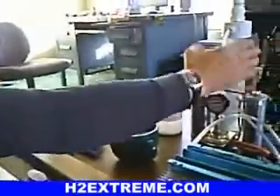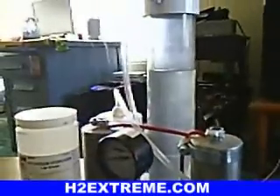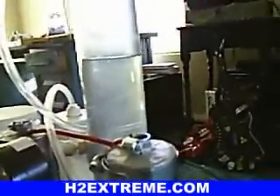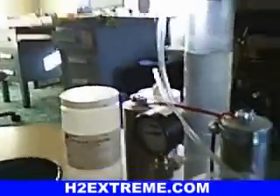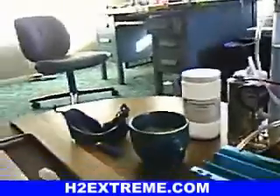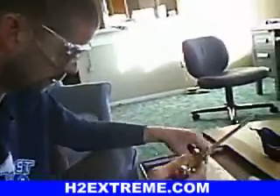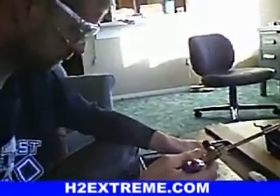That's the electrolyte used in the water mixture. And this water mixture, you notice, it's really clean. That has been ran for about two months with the same electrolyte, and it's used quite often. It's very clean because of the potassium hydroxide — it helps keep the scum down out of the water. Anyway, we're going to crank this on and do a demonstration and explain to you a few things.